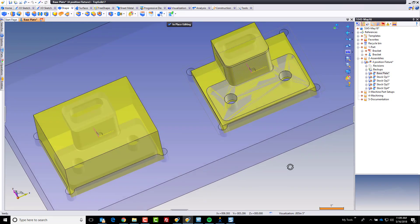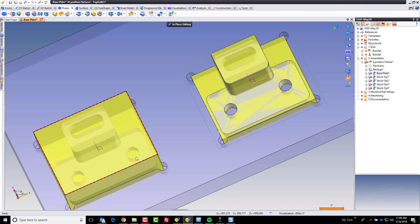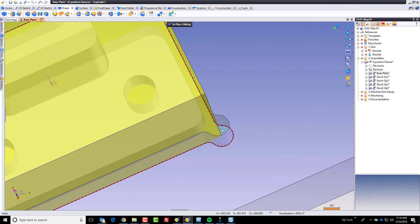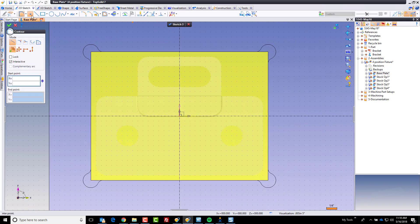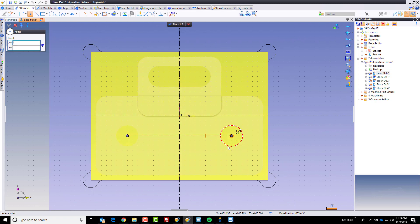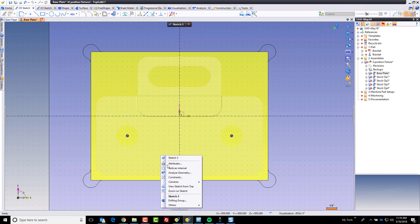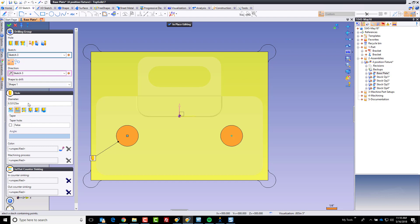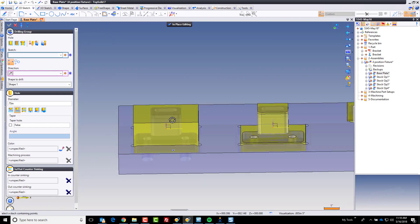We're going to do a drilling back here for the operation that's going to happen on this side. I'm going to select my face right there and build a sketch. I'll use drilling by sketch a lot because it's convenient — I can snap to the centers of existing holes. I'm going to create a drilling group, but I don't want the same size drilling as before; I'm going to go bigger — a three-quarter inch hole so the drill and chips can fall in nicely. It'll be a nice through hole.